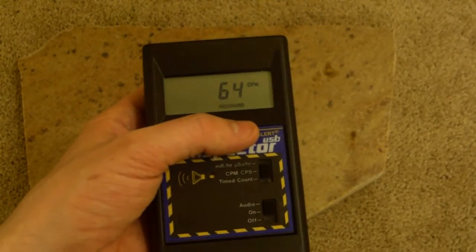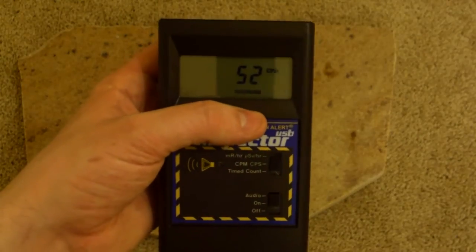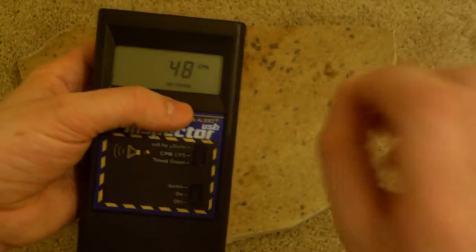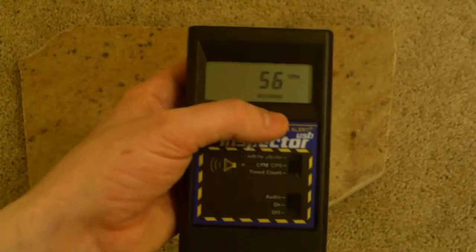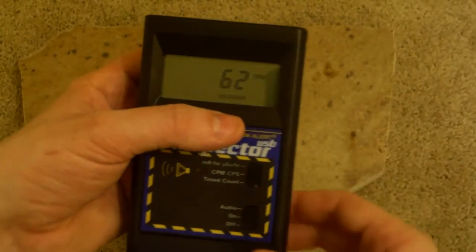And it'll record anywhere from about 1,000 minutes to several days worth of data, depending on what you set it to. You can set the recording interval times. You can say record once every 10 minutes if you like, once every hour, and technically you could stretch that out for a really long time, depending on how imprecise you want that to be.